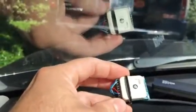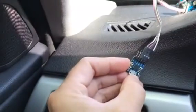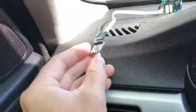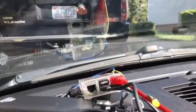This one is like $10 on eBay. It's wired up to the USB pins. It's a U-Blox chipset — it's a Neo7. This little module is just enough for me to see that the LED is blinking in it. It's hard to tell in the video, but it's blinking at about 10 Hz. The script actually programs it to 10 Hz mode when it boots up. It seems to be working.